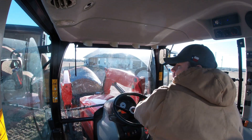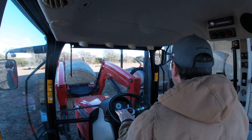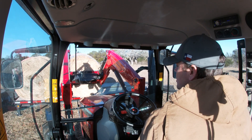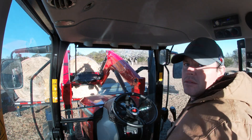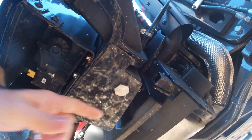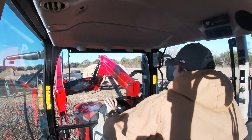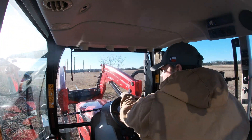It dilutes it even though it's a plastic tank — I'm not quite sure about condensation building up inside a plastic tank, but I guess anything's possible. I thought, well crap, I'm not going to drain the DEF tank, because all the ones I've been around on my pickups don't put a drain in them — they're just a solid plastic tank. But I got underneath it and let me show you where the drain is. Here's the DEF tank and right underneath it they put a drain in there. The engineers for AGCO, or whoever designed the DEF system, were actually using their brain and thinking about the end user.